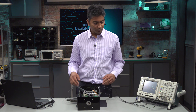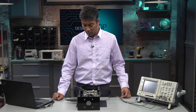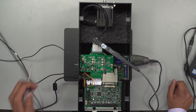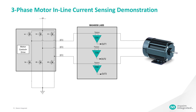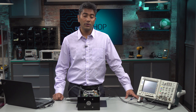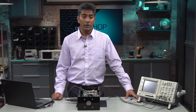This is a setup for a three-phase BLDC motor application in constant velocity mode. This over here is an industry available drive, which is driving an industry available 48-volt three-phase motor. What we have done is we have actually added three MAX456 current sense amplifiers inline, measuring each phase. We are also probing the current at one of the phases, and we want to see if the output of the current sense amplifier follows the probed current. Essentially, that's what we want to do, because that provides us some information about the responsiveness of the output of the current sense amplifier and how well the output follows the probed current.